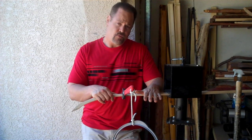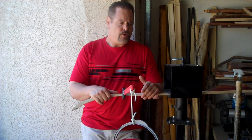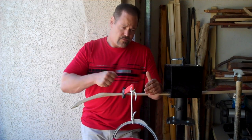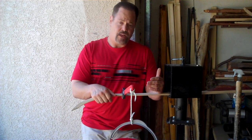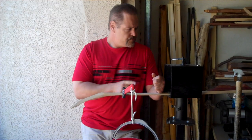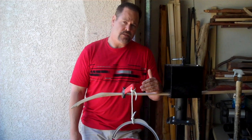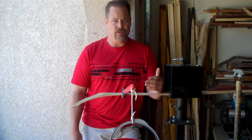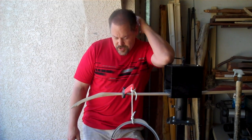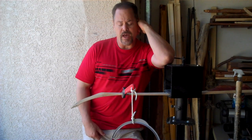Sometimes you can shave wood off of one side compared to the other because the twist will go to a stronger side. In the case of the Osage, you can just use dry heat on its own and just bend the twist out. I do that a lot with Osage. It's very, very forgiving wood. But whitewoods are a little tougher. They don't like holding whatever bend you want to induce in them unless you do a significant steam bend. And this is one way. Now, there's a reason why I'm doing this mousetrap looking apparatus here.